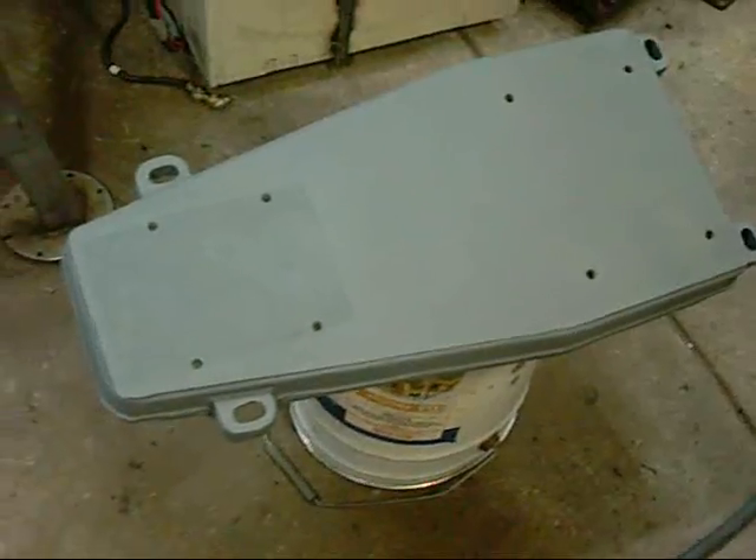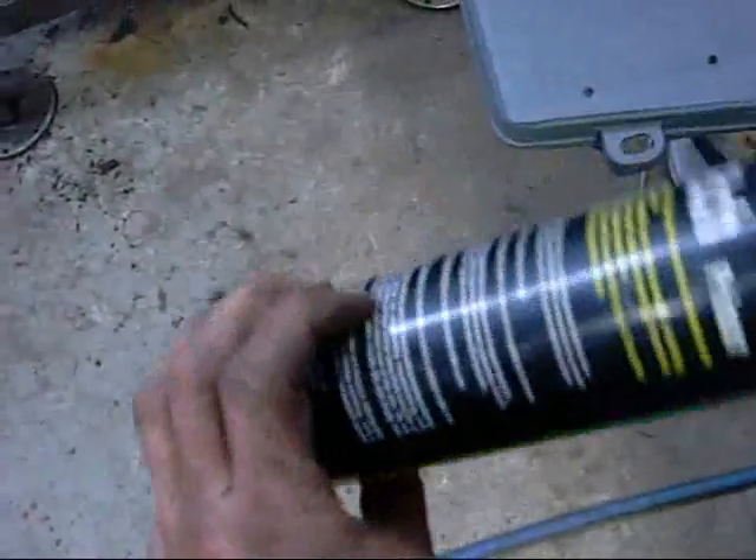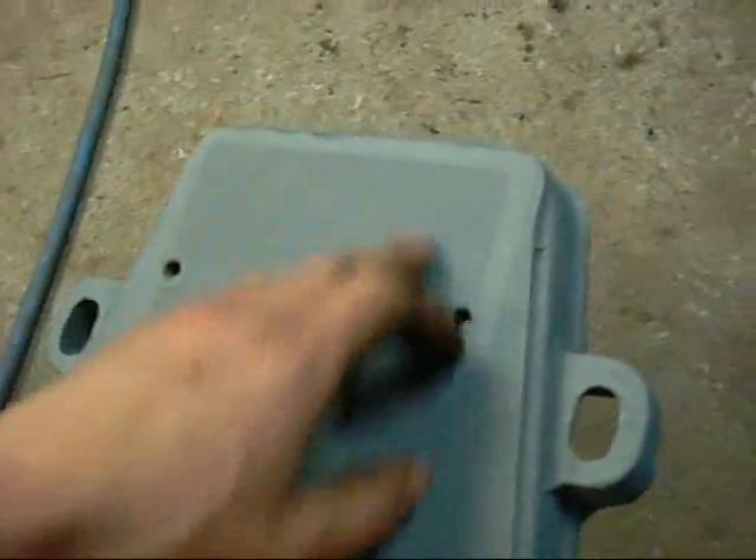That's running nicely — I'll leave that overnight. The base is done and already primed using the super etch epoxy — very good primer, probably one of the best you'll get in a spray can. Not a high build though, very flat and thin, but you cannot remove it — it's very hard to get off. You can see the corrosion where water was trapped under the pump housing, probably been there for about 20 years or so. That's the underside of the pump housing — it was leaching through tiny little pin holes which I've opened up. The whole housing is rusted through on this waste lubricant sump. The main packing and gland in the pump housing leaked for a prolonged time and just rusted it all out — that's why there was water trapped underneath. All going to be fixed up.